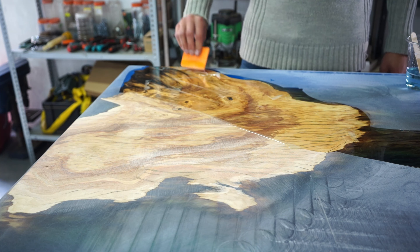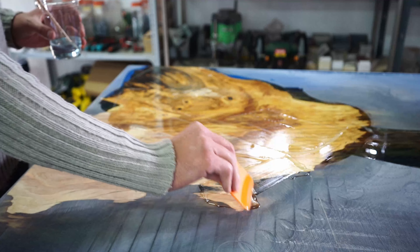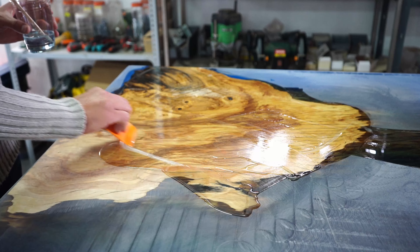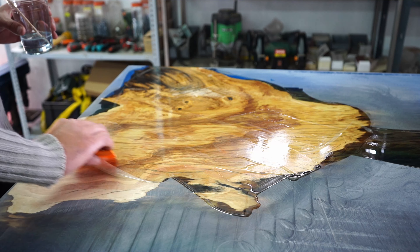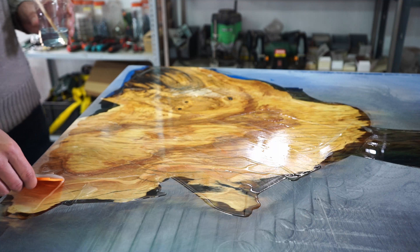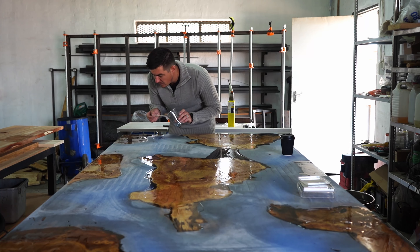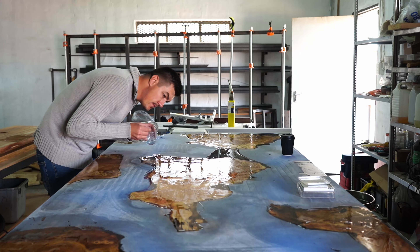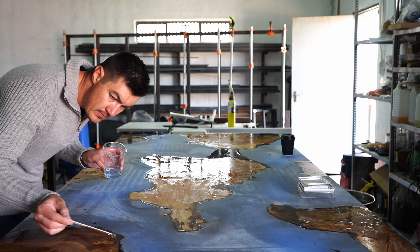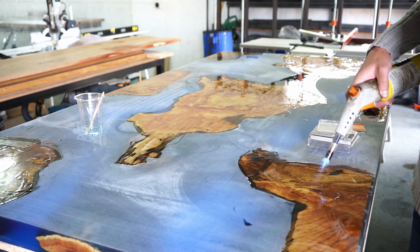Once done with this step, we leave this top coat of epoxy for around two days to give it time to penetrate into the wood. It's important to know that the epoxy we used to cast the table and the epoxy used now for the top coat are two different types. If you use deep casting epoxy for this top coat, you'll almost certainly wait three to five days for it to cure because deep casting epoxy is not designed to be cast in a thin layer — it's designed for thick layers. That's quite crucial. I'm continuously closing all the small cracks and holes because the epoxy keeps going into them.